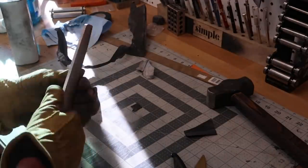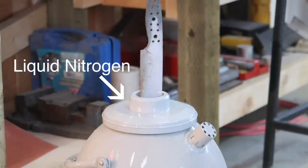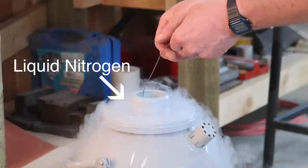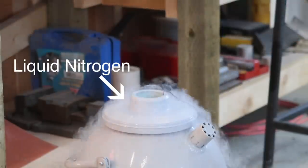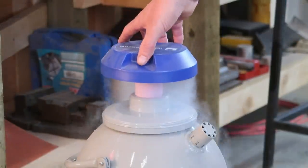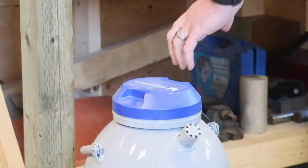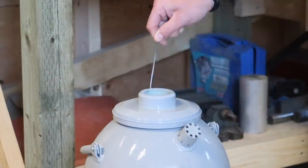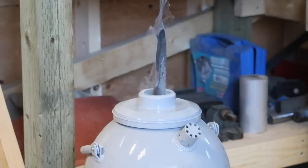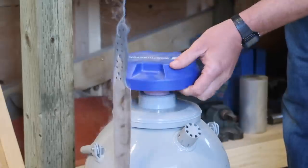Now that we've got this done, before I do any tempering, I'm going to give it a deep cryogenic treatment — putting it into my dewar full of liquid nitrogen and letting it sit there overnight. It's kind of the fun sciencey bit that I'm really enjoying lately in knife making. We'll go into more information about why you would do this and the benefits in the heat treating stainless steels video. It is so much fun working with this stuff. Frosting.